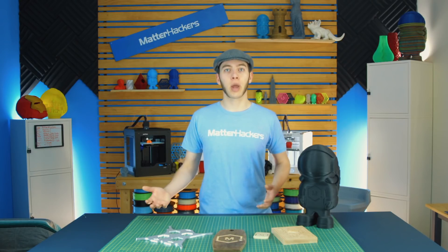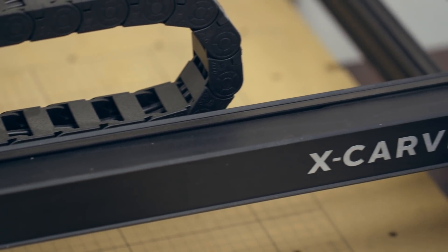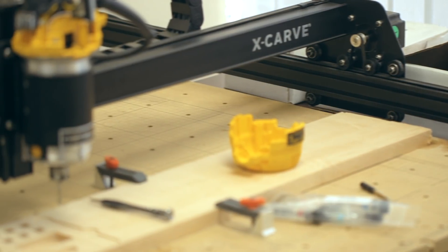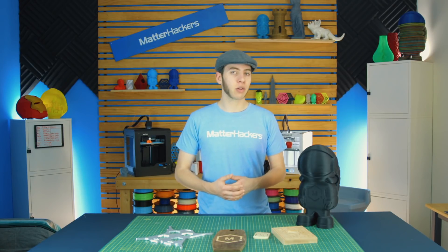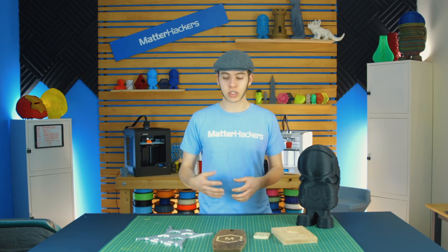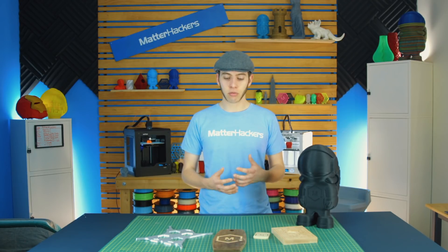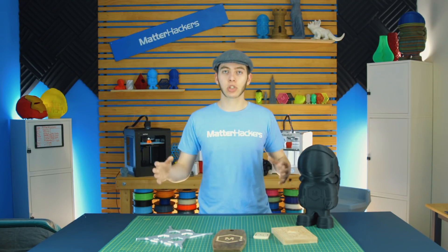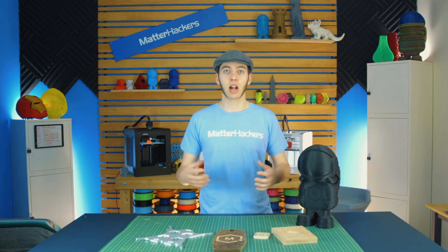Now besides desktop, there are also large format 3D Carvers. Those are usually kits because that's easier to ship — you have long aluminum extrusions and big sheets of wood that have to go together. They're usually cheaper and pretty easy to assemble; it's just a couple parts screwed together and mounted, and all the instructions are very self-explanatory. You're not limiting yourself on materials either — you can still cut wood, metals like aluminum or copper, or hardwood like walnut. They're all very capable machines, just with a much larger cutting area. If you're a classroom, something like an X-Carve wouldn't be ideal because it's dusty and takes up a lot of space, but if you have a workshop, it is a very valuable tool.